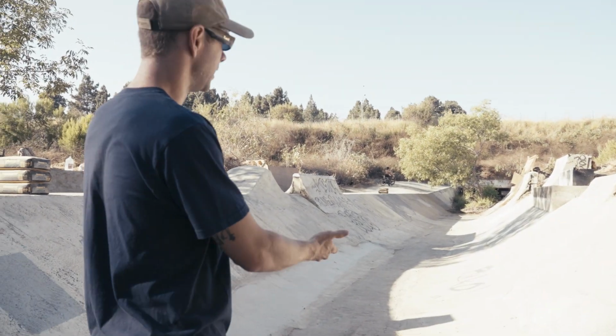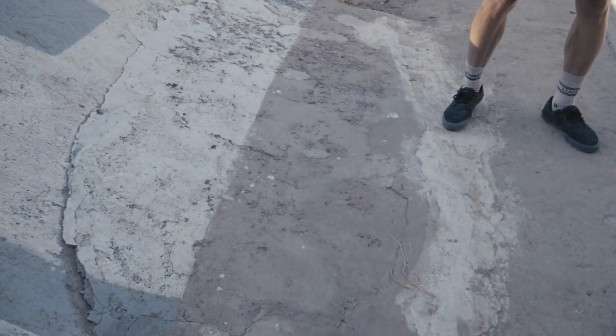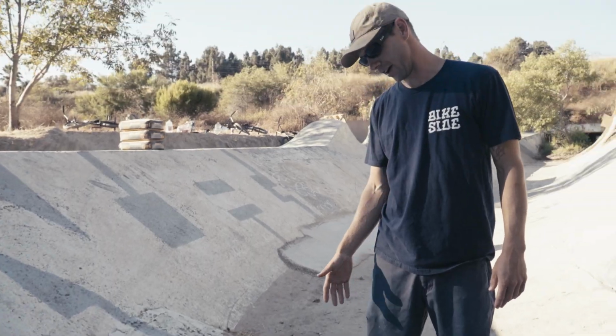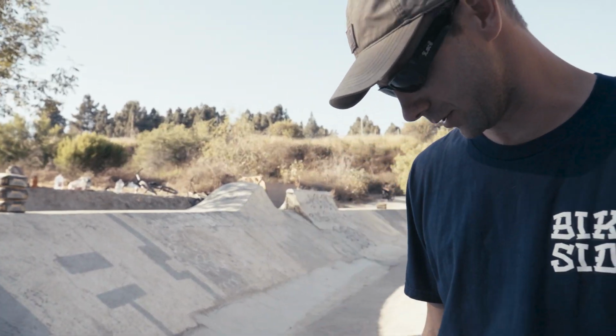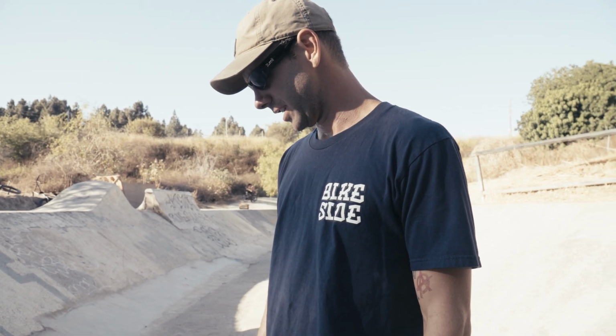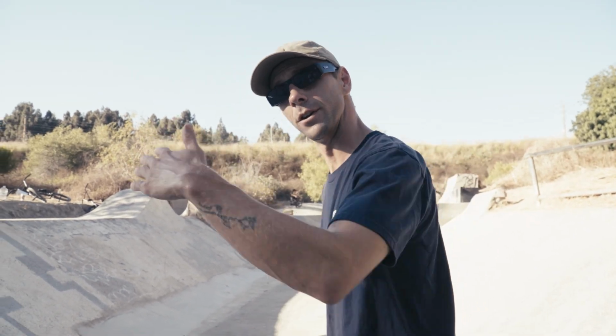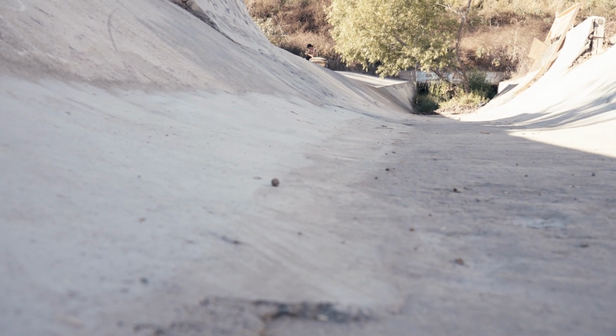All right, so here we got our R&D on our transition builds. This was actually the first one I did with the high strength concrete. It's very bumpy. I don't think I used wood to get the cream to come to the top, and then we have just like a Cementol rapid mortar right here to blend it, which I did recently. But if you come over here, this is what we've been working with lately, where we got the high strength in the middle, and then we just blend it with mortar.